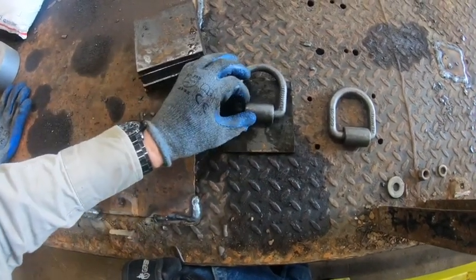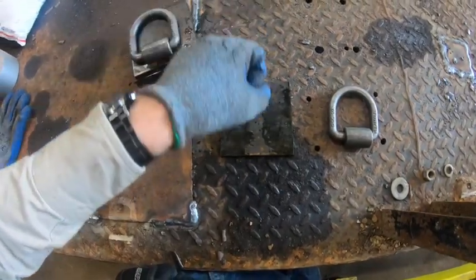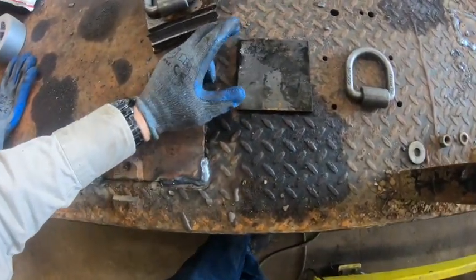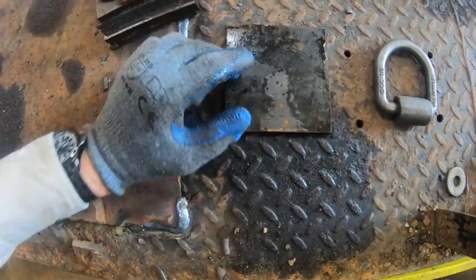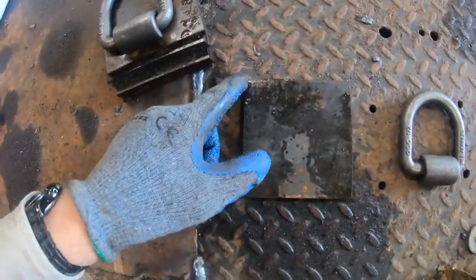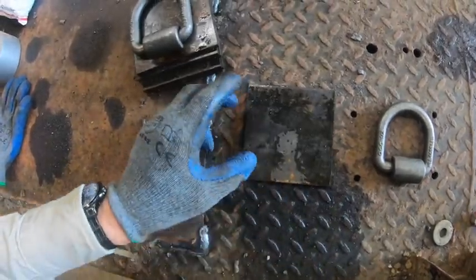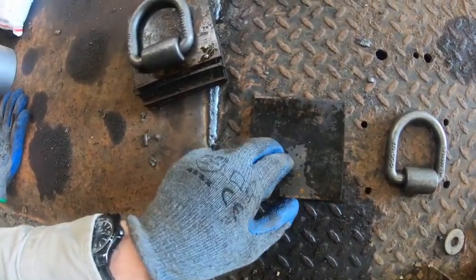So definitely weld to something like this. Now if you really want to go all out, I would recommend you make a circular plate — that way you're pretty much guaranteed an even distribution of force without force concentrating around any of the corners. On a welding note, when you go to attach these plates it's really important that you try to weld around the corners, because welds normally start to crack at the beginning or end of a weld, and structurally things usually start to crack around corners. If you start and stop at each corner you're setting yourself up for failure, but if you can weld around the corners without stopping, you're left with a much stronger finished piece.